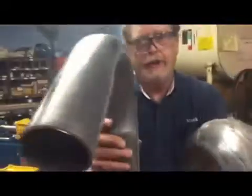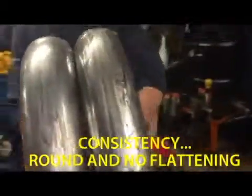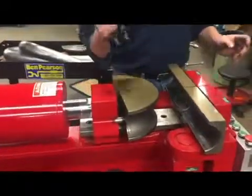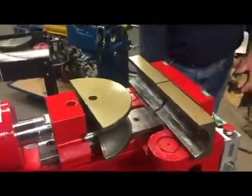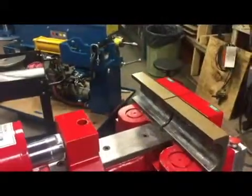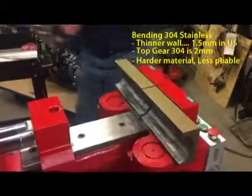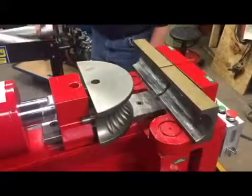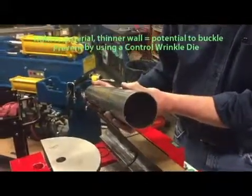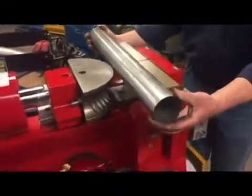Earlier we bent some aluminized three-inch — a much milder material — and you can see how consistent it is throughout the materials. Now we'll try another material, which is 304 stainless. 304 is really nice for exhaust systems, but normally when you get your 304 material, it's going to come in a thinner wall thickness per the diameter — instead of two millimeters, it'll be 1.5 millimeters. So this is a much lighter tube, and what can happen, because it's got a thinner wall and it's a less pliable material, it may tend to occasionally buckle. So what we're going to do is control the uniformity of the bend with the controlled wrinkle die.